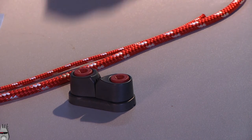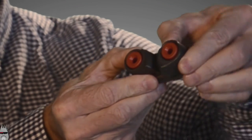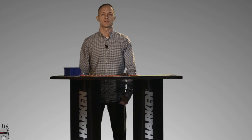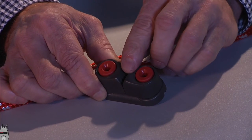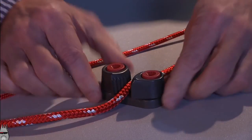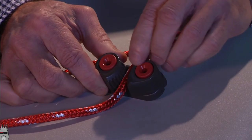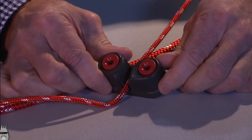The second major design element is the pawl. Besides securing a line, a cam cleat should be kind to it so it doesn't tear it or shorten its life. So how do we design the pawl to be strong enough to hold a ton of load but not damage the line? The key lies in the design of this curve so that the angle to the point of contact is the same, whether we're using a big line or a small line.